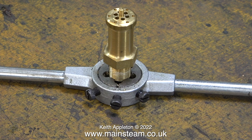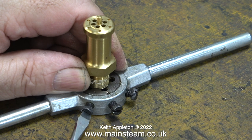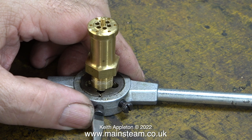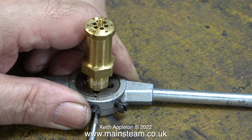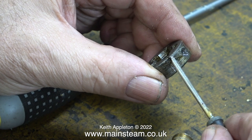What I'm about to do next is make a blanking plug for a boiler. This is obviously a safety valve and it has a thread which is half inch by 26 threads per inch. The first part of the job is to adjust the die so that I don't cut a thread that is too small, but I immediately ran into a problem — I couldn't open the die wide enough with the center screw to match the thread on the safety valve.